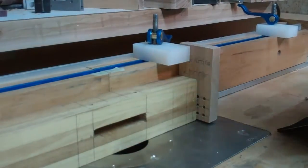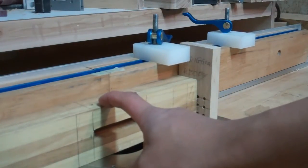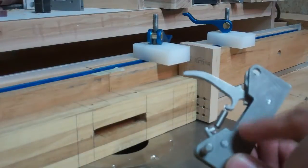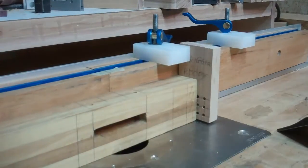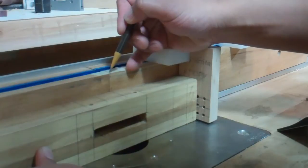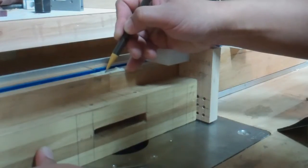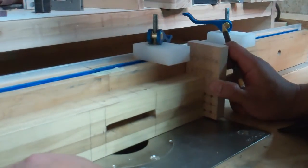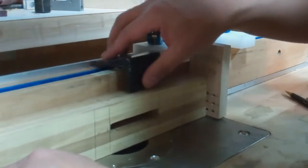And then likewise, we're going to do the aft end. Now we're going to — you can go off the mark that's on the gun for the forward end of the line release slot, or you can take a measurement off the side of the trigger mechanism. I'm just going to use the mark that I put on the side of the gun. So I know that this is the right side of the router bit, so I'm going to eyeball the left side of it an 1/8 inch over. That's where my bit would lie, and I'm going to slide that over and try to get it lined up with the line that's on the gun.